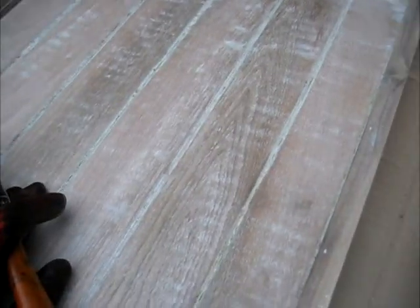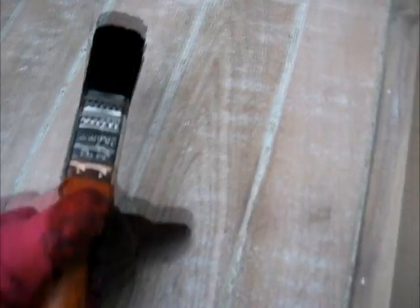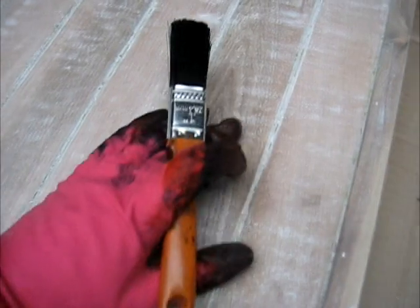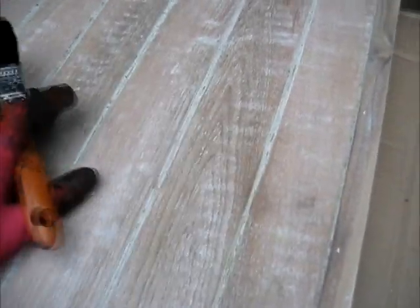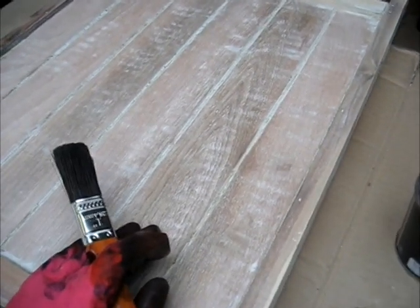And not only that, if you just stain this whole thing brown now, you'll get this flat brown colour, whereas if you stain it black first, what happens is all these little grains become black, and when you do a gentle sand they still stay black, so you get a much richer texture of the wood. And that, like I said, was by sheer accident.